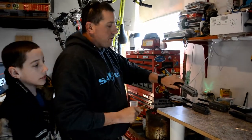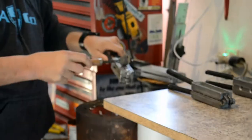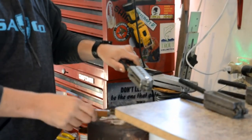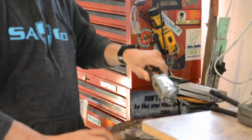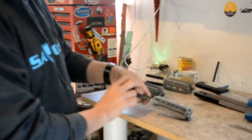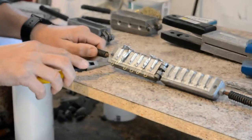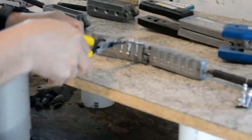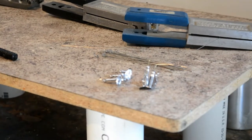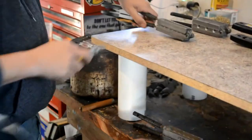I'm going to take my jigs here and I can pour one cavity at a time, or I can fill up that ladle and do three or four at a time. I go over to my little table, open it up, and there you have it — there's the jig, the hook, and this part here is called the gate. I'm going to grab it by the gate and pull them out. Still very hot. Then I leave it open and get it ready to start laying the second hooks.